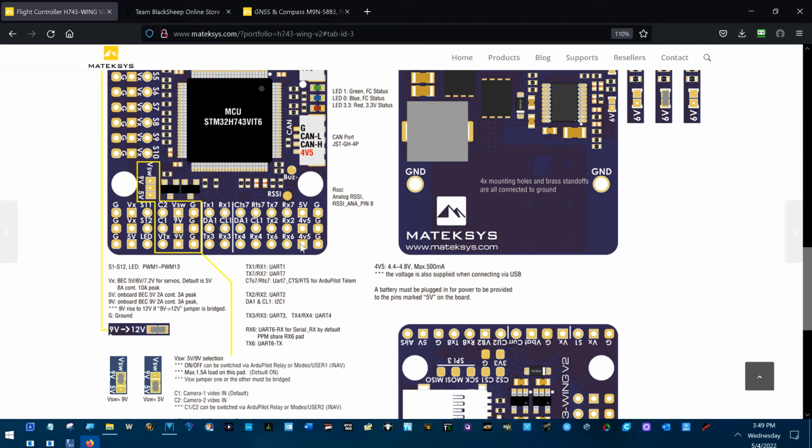Or I could have put 2 connectors on that receiver, a 4-pin DuPont connector and a 2-pin DuPont connector, and I could have put it across these 4 pins for CRSF and MAVLink, and then put the 2-pin DuPont connector over these 2 pins, and I would be at 2 amps max and never get in trouble running that 500 milliamp Nano Pro and the GPS on a voltage.